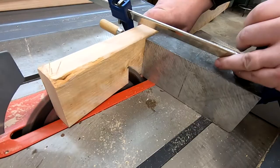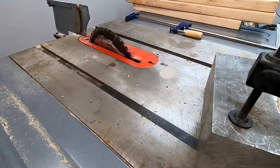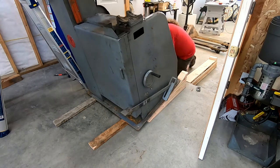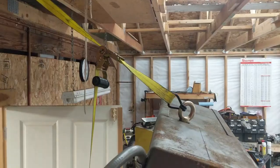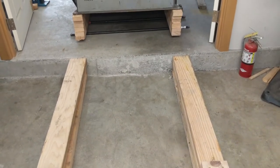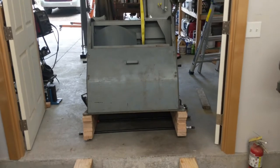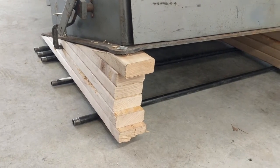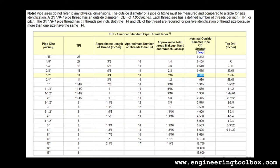That's far too shallow for a normal miter cut, so I had to get creative with the table saw. Have I mentioned the table saw scares me more than any other tool I have? The next day I started — first moving the saw into position in front of the doorway, then lifting one side so the angled skids could be inserted. I attached a cargo strap around a board that runs across the rafters, purely as an emergency backup to prevent a catastrophic fall from even starting. In retrospect, I should have used a chain hoist and not a cargo strap, as adjusting it was a real pain and sometimes put me in dangerous positions. I was just being lazy and I have no excuse for that. A stout stack of 2x8s served as blocking on the inner side, with some stops screwed in on top just in case it started to roll out of control. The move itself was done on half-inch pipe as rollers. For those of you who live in more civilized countries, know that there is nothing half-inch about half-inch pipe — not the inner diameter, not the outer diameter, not the wall thickness. None of the pipe sizes are anywhere close to the size they claim to be. It's exceedingly silly.